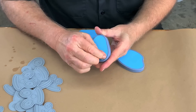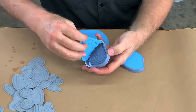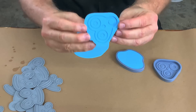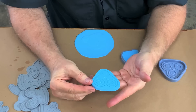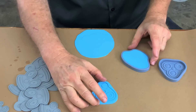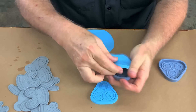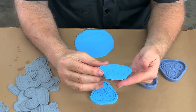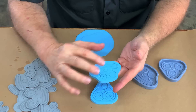I let this rubber cure overnight, and now we're ready to pull it out and see what we got. Let's see how hard these are going to be to pull out. I'm wagering not too hard — and I was right. They're going to pull right on out. I haven't seen it yet; I don't know what it looks like. What do you guys think? Is it any good? I had it upside down. There you go — clean as a whistle. Excelente! I love it. Same thing over here. Oh, they're perfect. Look at that — these little tendrils of rubber, super fine. That just got all the way down in there. That was the advantage of sucking those out with vac. It does work, as long as you know you're not going to kill your molds.